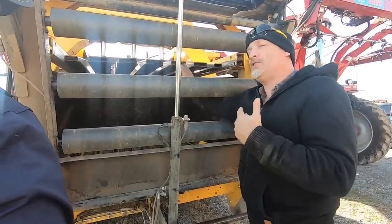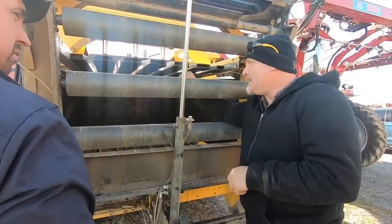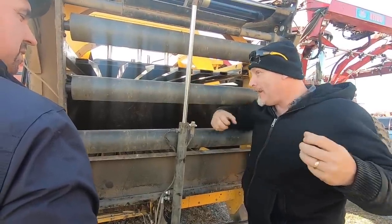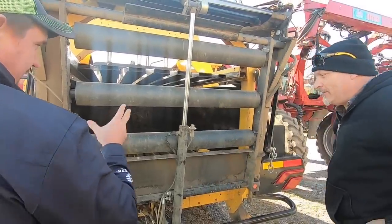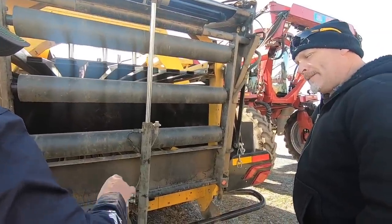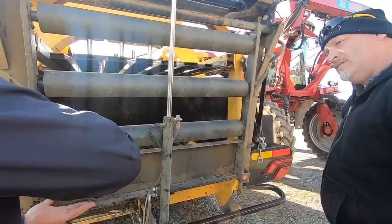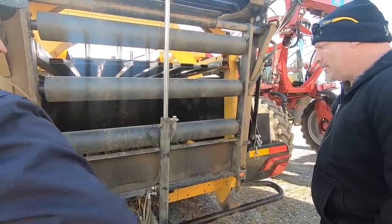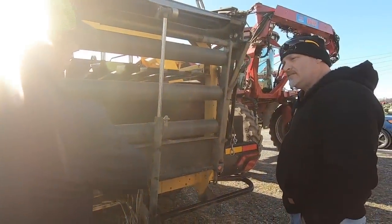So what you do is you leave the baler run, and then you'll squeeze it until you know. So you'll pull it out a little bit, and then you'll squeeze it back down again until you get it. I tried my density on the screen. I'll put it down and set it at like 100, so it keeps everything down there to hold it down a little bit, not squeezing the bale.